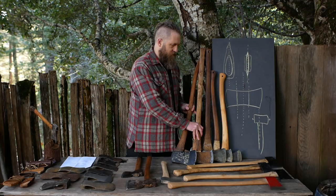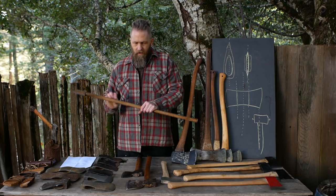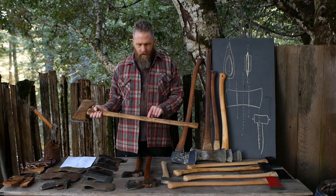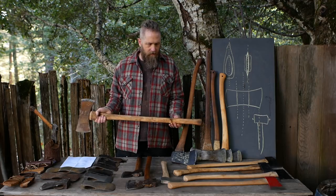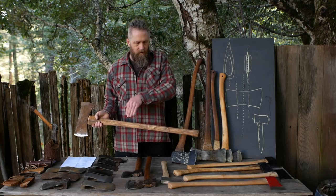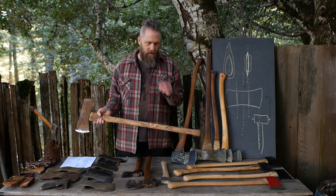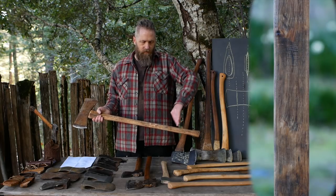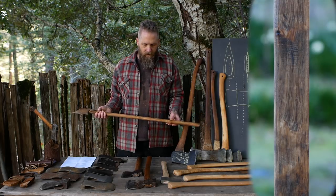How that plays out — whether the tree had more sun, better nutrition, more or less water — I don't know, but those things obviously have an effect. Aside from run-out and grain orientation, there are also knots and other weird stuff. This handle has numerous knots, or areas next to a knot, and there's one that's partially fallen out. That affects both strength and stability — this handle is warped in multiple directions and has a propeller twist, all because of this section of wood with knots.